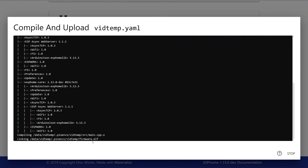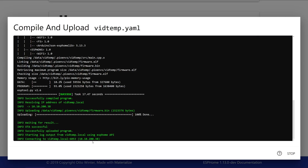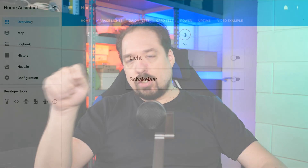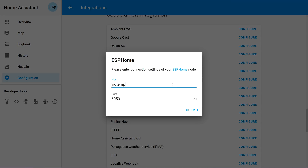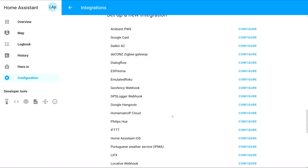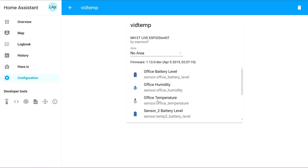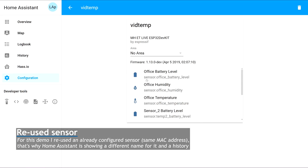Go back to the blog post and copy the second part of the configuration file. There you see two sensors listed, and what you need to do is change those MAC addresses to the ones you found during the scanning. You can also set the logical names per sensor — that is the logical names that will identify itself to Home Assistant, so you can set things like living room, bedroom, kitchen, garage, wherever you're going to put the sensor. These ESP32s are pretty powerful so you could do lots of things with them — different sensors, switches, or LED dimmers connected — so you don't have to use it just for having the temperature sensors connected. Once that is done, upload that new configuration using OTA to the ESP32 module and then we're ready to add this to Home Assistant. In Home Assistant, go to Settings and then Integrations, and once you scroll down a little bit, you should see ESPHome and an Add button. Add the ESPHome module using the name you used before, then enter .local and enter the API password if you set one. Wait a few seconds, hit refresh on your browser, and then it should be added in your integrations list and Home Assistant should have automatically detected the temperature, humidity, and battery values per module you listed in the configuration file.